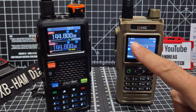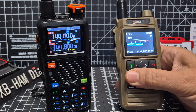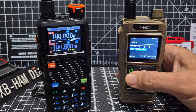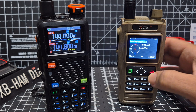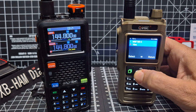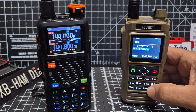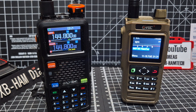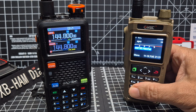Using the software we put in extra information. On the VGC, we literally just set 144.800 — it's called APRS — we just set that frequency. I haven't turned anything on at all, just set the frequency. Once it receives that, you push the right arrow and all the information is there. It is receiving that information. It's not showing on APRS.fi or anything like that, but the VGC radio is able to decode what's coming from the UV5RH.